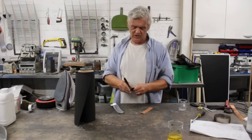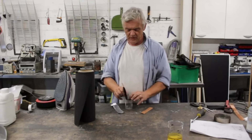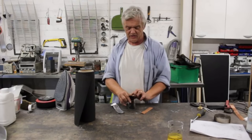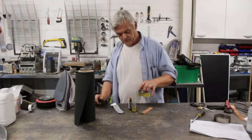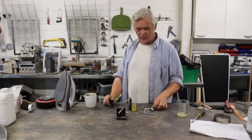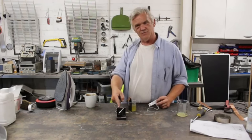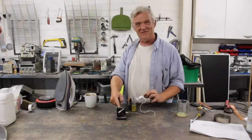I have been through this before when we did a bromine battery, and you'll see that on the members channel. This is exactly how to make the cathode. We just stick the cathode in the bottom because that's where the iodine is going to be, and then we can add our electrolyte. Now we can add our zinc to the top section and we're ready to go.